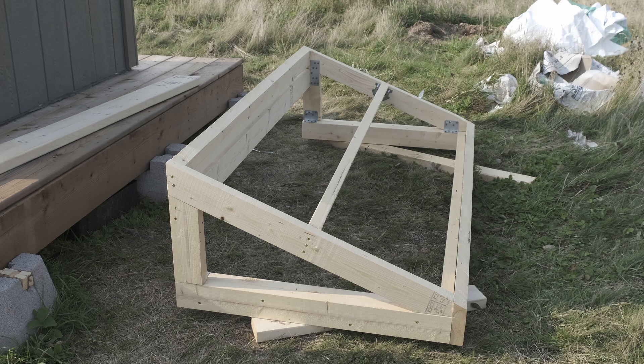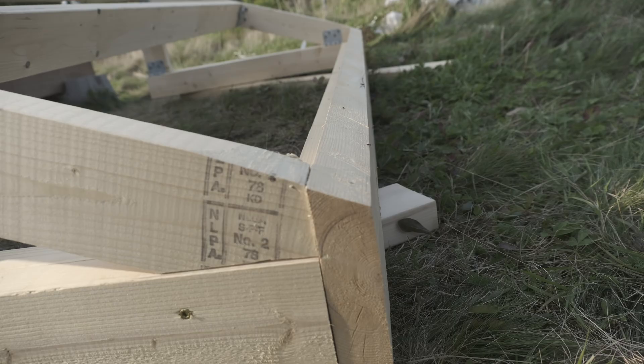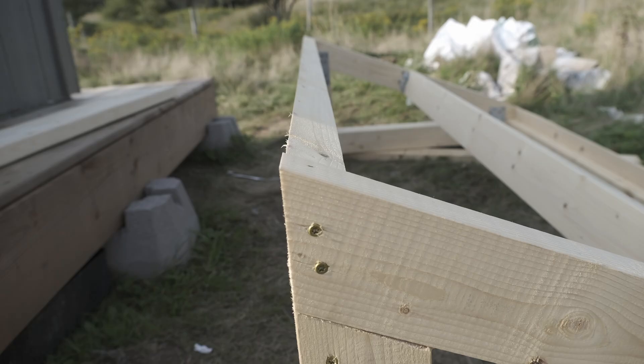With this done, it's time to get back to work on the roof. This is the side of the roof that will face the eastern horizon, and I completed building this frame last week. All it needs is marine grade plywood screwed onto the sides and tops, but before that I'm going to build its mate for the west half of the roof. The split roof is both a complicated yet simple project — each side consists of only 13 pieces of wood, constructed out of only about 4 or 5 2x4s and a single 2x6. But the upper and lower beams require careful angling to 24 degrees, and since I don't have a table saw, that has to be managed with the circular saw. I think I did an okay job — certainly functional, honestly more than functional. It's pretty accurate, because when I cut these angles I fashion jigs to hold the circular saw stable out of some scrap wood.